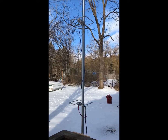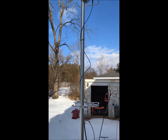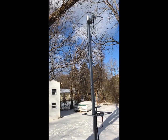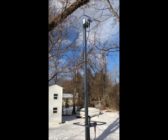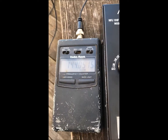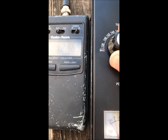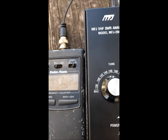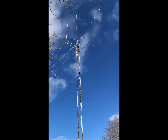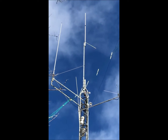They should end up around 50 feet off the ground — should work good. As a test, I moved them up the pole and rotated them 90 degrees just to simulate taking them off and putting them back on as per the documented instructions, and it stayed pretty decent. We're at 144 and SWR is still fantastic — it shouldn't have changed, but I just wanted to make sure.